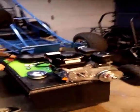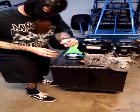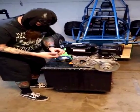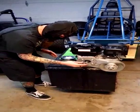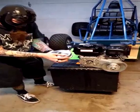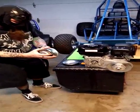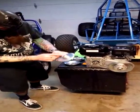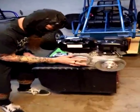This takes a little lining up to do. This particular model needed some washers to space the clutch out. First you put on your collar, and then you put on the necessary amount of washers to line up your pulleys — this one needed two. Here's your clutch unit. You can take the cover off and set it to the side for now because you're going to be doing the backside first. The backside has a keyway — you've got to line up the keyway and put it to the back.